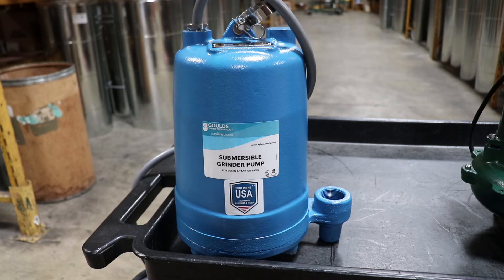The second case is uncontrolled environments. Ideally we're only flushing toilet paper and human waste, but the reality is people flush flushable wipes — Lysol wipes, baby wipes, maybe makeup remover pads. They do go down a toilet, but once they do they often cause issues like clogging pumps and blocking sewer lines. If you flush these things and you have a grinder pump, the grinder is going to take them and grind them into a pulp. Grinder pumps can handle these flushable wipes.